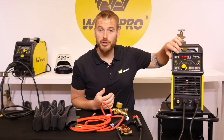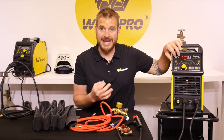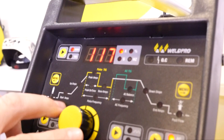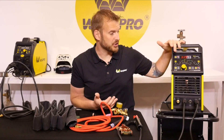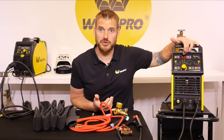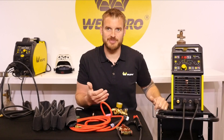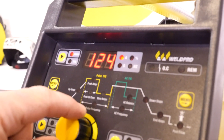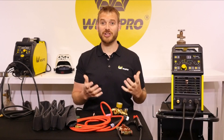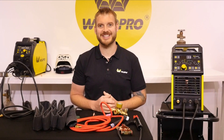Go ahead and turn the little red switch on the back of your machine to energize it. In the upper left corner of your display, there's a selector button that will allow you to change between MMA and TIG mode. With MMA mode selected, you'll notice an amperage readout on the screen — this is the amperage output to your electrode. The desired current can be changed using the large selector dial on the front of the machine. With our leads connected and everything set up, we're pretty much ready to stick weld.